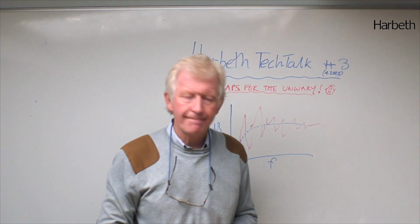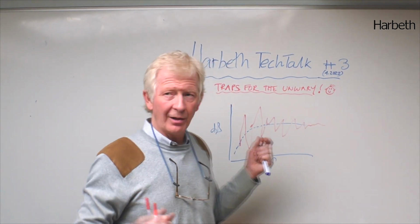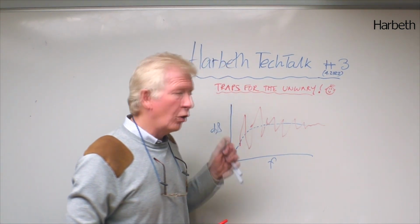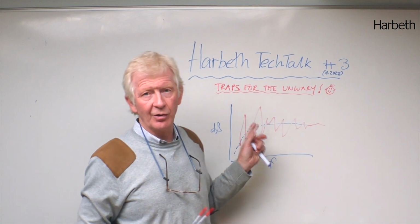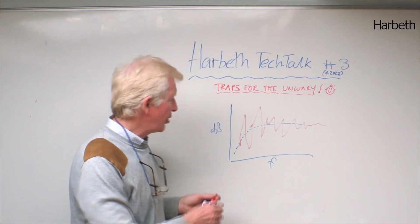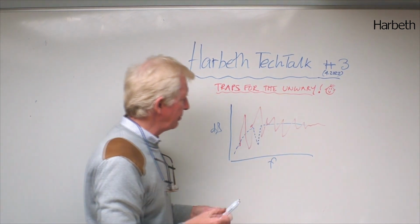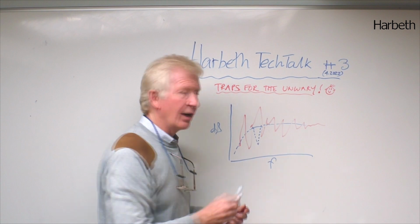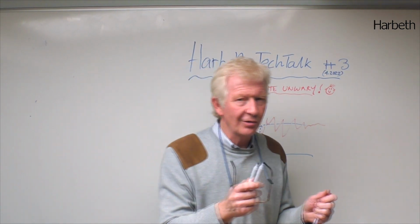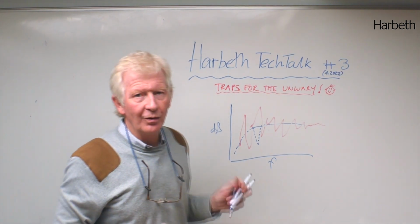something like that. And if you want to do something about that, you're either going to have to apply damping to the acoustics of the room, which may or may not be domestically acceptable, or you might be lucky and be able to introduce some sort of electronic counter peaking system, such as miniDSP, which in effect will take these peaks, apply electrically the opposite effect in the loudspeaker, the peak cancels the trough, and you get a flat response. Of course, you move your head a metre or so either way, you've got a somewhat different picture of resonances in the room, so it won't cancel those.